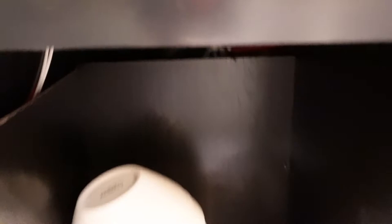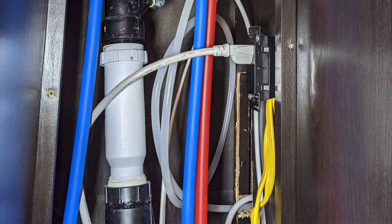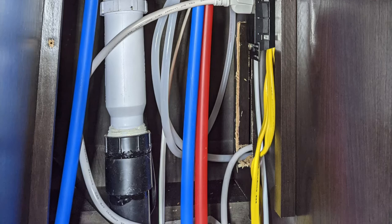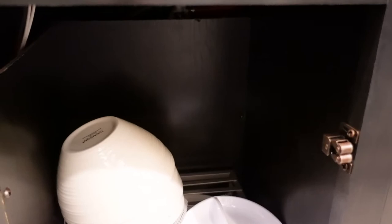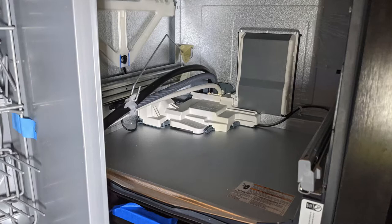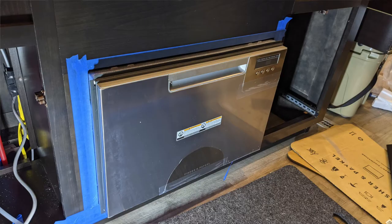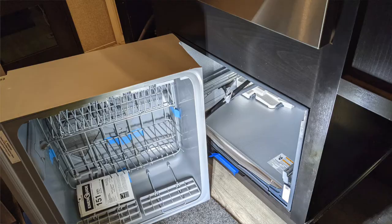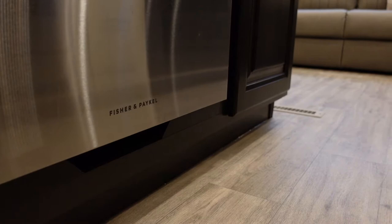I also made an opening toward the back of the center cabinet section that spills into the access space in the leftmost cabinet. There's a little access panel in the left cabinet where the drain, water connections, and the relocated 120-volt outlet are all hidden. That opening is completely hidden but made it much easier to route the water, drain, and electrical from the dishwasher to the connections on the left side. That was about it on the physical modifications — definitely more involved than I anticipated, mainly due to choosing the Fisher Paykel over the Vesta.